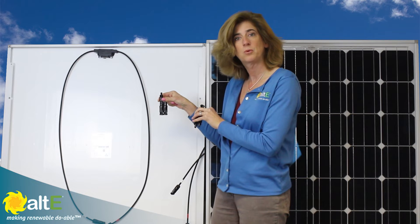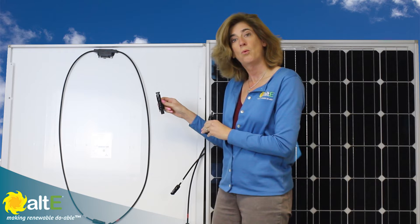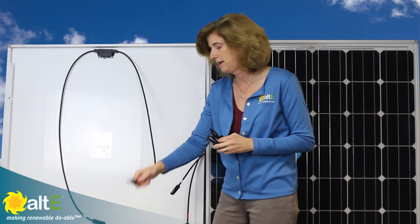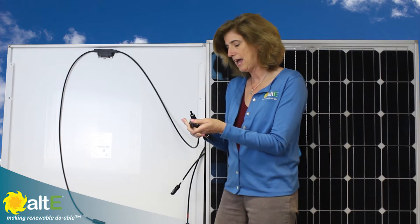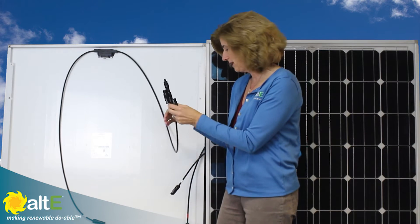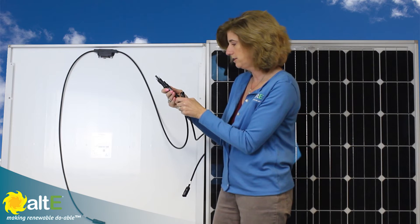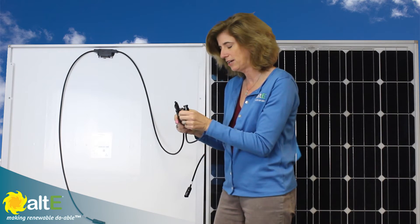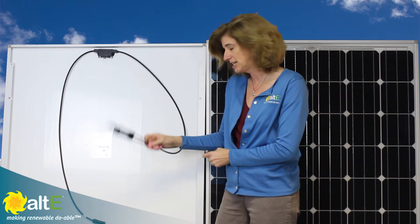So it's very important that you understand how they sex these so that you get the right ones. You're going to have one of each — one that's one female and two males, and one that's one male and two females. You're going to take the female from one panel and plug it into the connector, then take the female from the other panel and click that in together. You hear it's got a nice click with that locking connector. That wires your positives together.